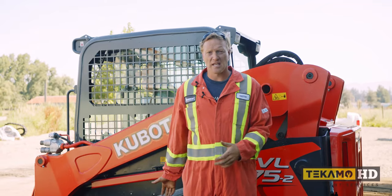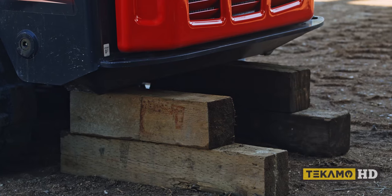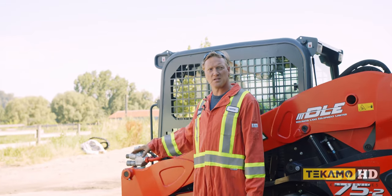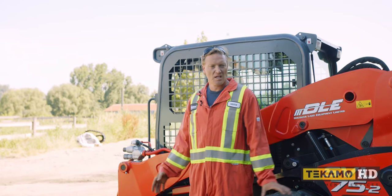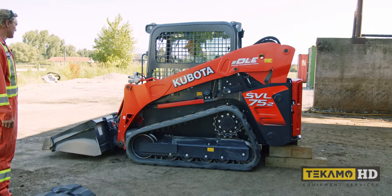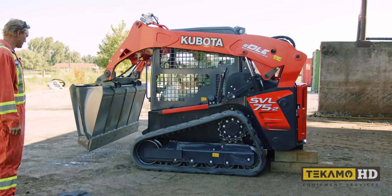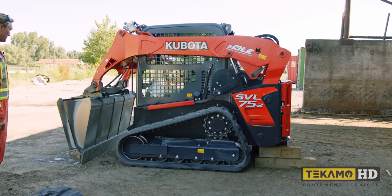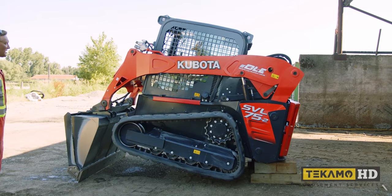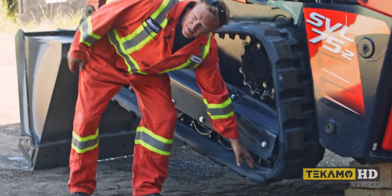The first thing we need to do is get this thing up in the air. At the back I set up some sturdy blocking so the machine can't fall over, and it'll lift up on both these blocks. We fire up the machine, lift the boom up in the air, tilt the bucket forwards, and when we put the bucket on the ground and press down, it pivots on the back blocks and lifts the track in the air, giving us room to change the track. You can see we're high enough — we have clearance all the way around to get the track off and out from under the rollers and idlers.